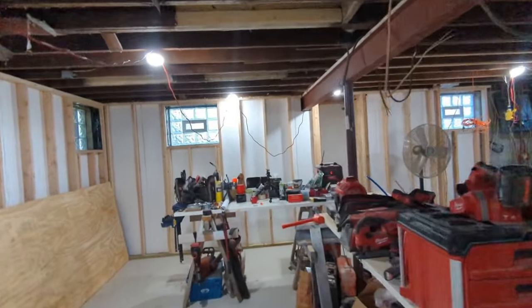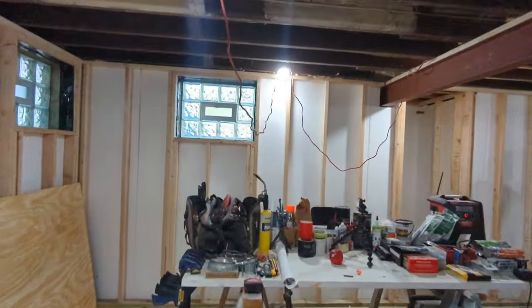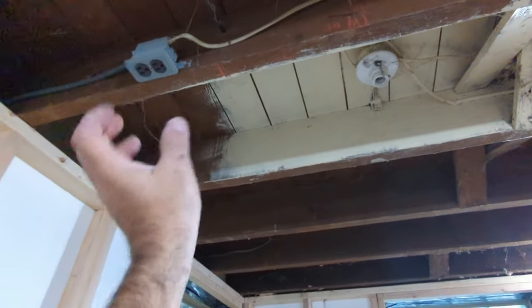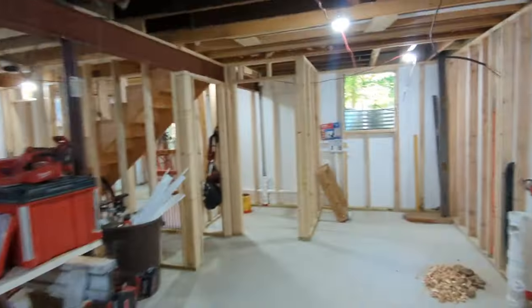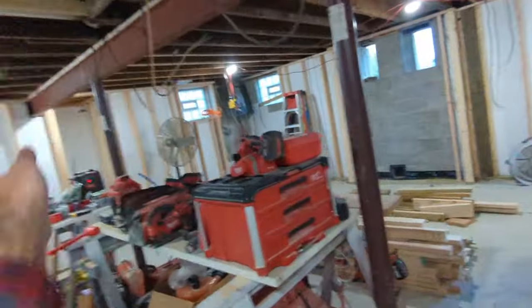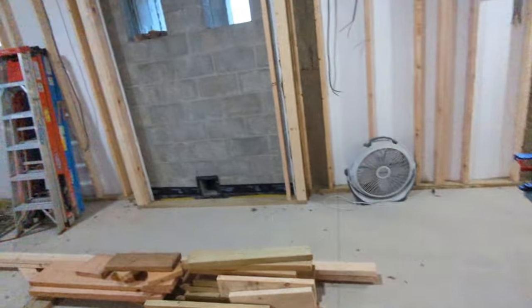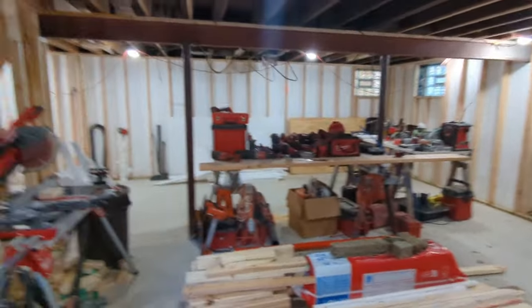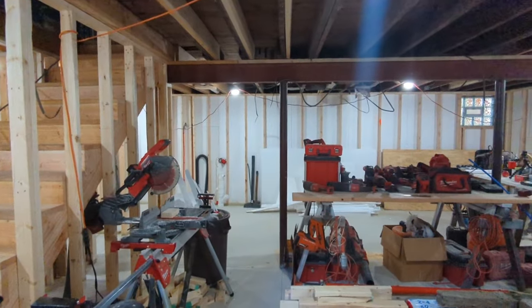And so someday, if somebody wanted to, you'd probably wait until you were ready to finish the ceiling or something. But each one of those could be gutted. You could take the outlet guts out of it, it could become a junction box, and you could go into that and hardwire, and you'd be real close to keep it all lined up. Maybe two courses in, or one course through here on center, two courses through here on center. And so everything will look sharp if you go to hardwired fixtures in a clean finished ceiling. It's still the switch circuitry, blah, blah, blah.